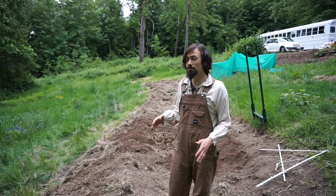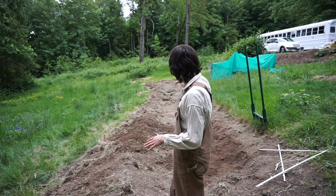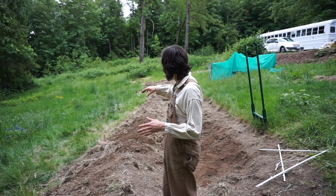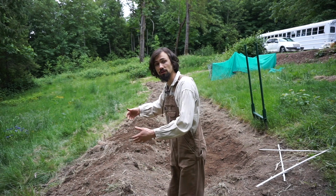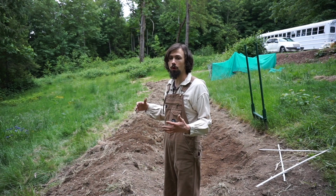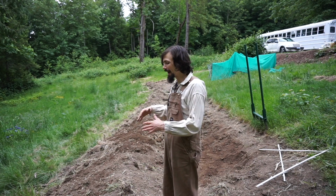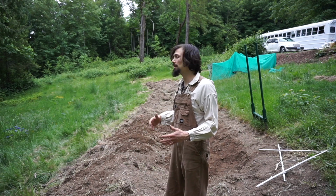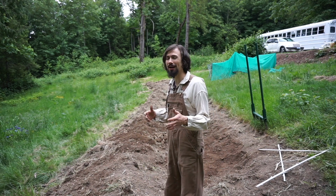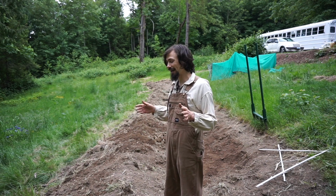In the temperate, in the humid climates, we're gonna want an uncompacted berm. You're gonna wanna set a line with some sort of device that helps you create level. And then you're going to start cutting from that line uphill and putting everything else downhill. And in a dryland situation where you wanna stop the water and soak it in right there, you're gonna have compacted berms. So you're gonna compact your berm rather than leave it uncompacted. If you wanna check out the most amazing, in-depth, encyclopedic book on dryland earthworks, check out Brad Lancaster's volume 2 of Rainwater Harvesting. Absolutely incredible.